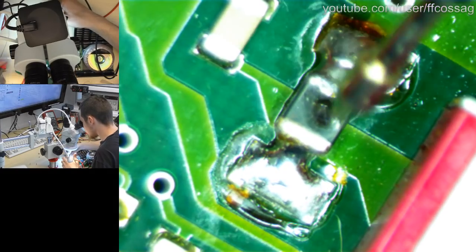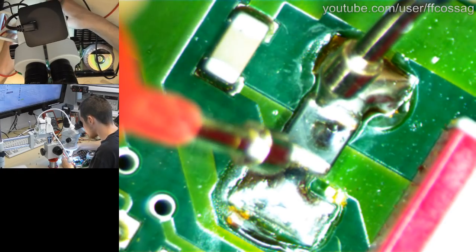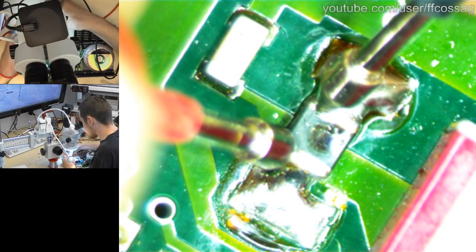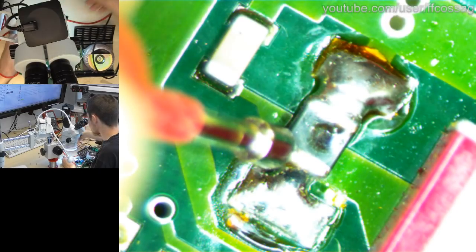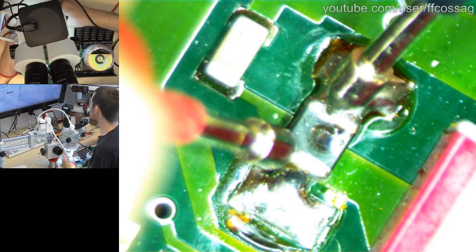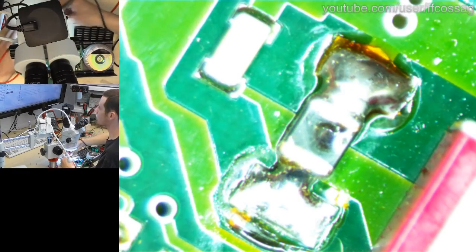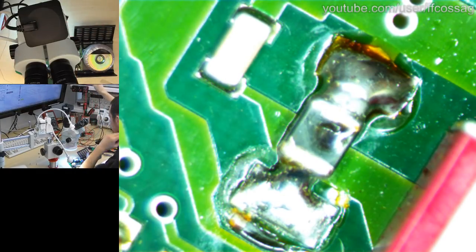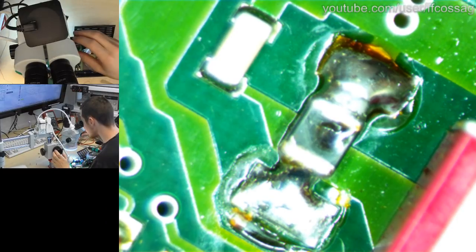This is measuring all kinds of weird. But I'm not sure what this even is, what type of component it would be. It is not a short. Is that some kind of capacitor? That would be very strange. It's measuring 130 nano. So that could be a capacitor.